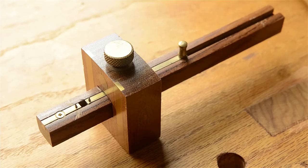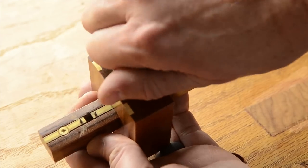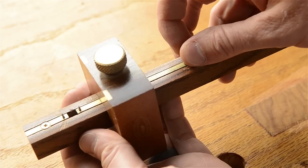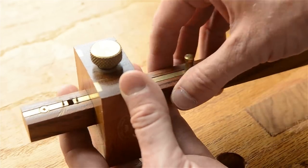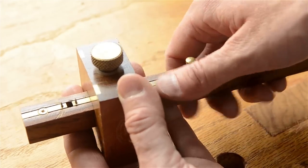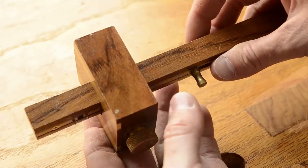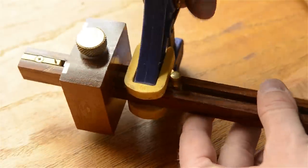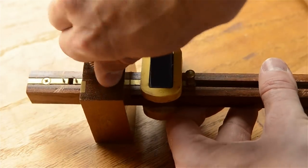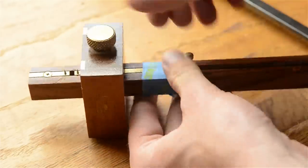That leads me to a modern style of mortise gauge that I would strongly caution against buying. This style is very common among cheap new tool sellers. The gauge looks really pretty, but when you loosen the thumb screw to adjust the fence, it is very, very difficult to keep the pins from moving, and then you'll lose your measurement. So I wouldn't recommend buying one. But if you've already purchased one, don't throw it in the trash — it is inconvenient, but you can grab a quick-grip clamp and tighten the sliding bar in place before you loosen the thumb screw. You could also use some painter's tape to hold it in place.